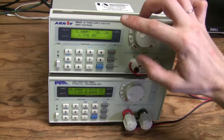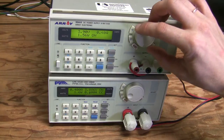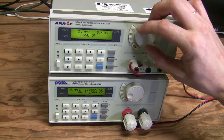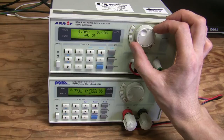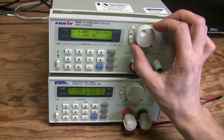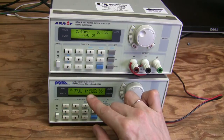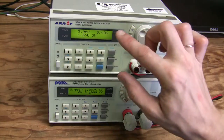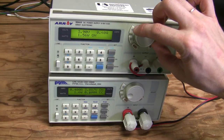This happens exactly when changing from 3.9 to 4 volts, in hundreds of millivolts steps. You can see the clear effect — it happens every time. The transition from 3.9 to 4 and back from 4 to 3.9: first the voltage goes to zero, then after a second or two I hear a click and it goes back and works fine after that.